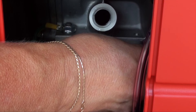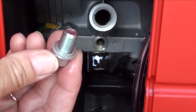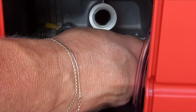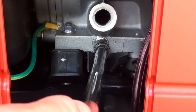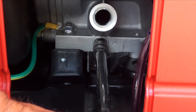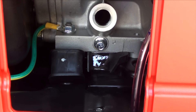Just take your plug and put it right back in there. I don't know if they make a magnetic plug for these yet, or a magnetic dipstick, but if they do it's always a good idea to have those. I usually put those in things if I can find them — not only does it pick up chunks of metal, it kind of gives you an idea of the health of your engine. If you start seeing a lot of metal in there, you might have some problems. There probably is a torque spec for this; I don't have my book on hand, but I'm going to snug it up — not terribly tight, because I think that might be an aluminum block in there.